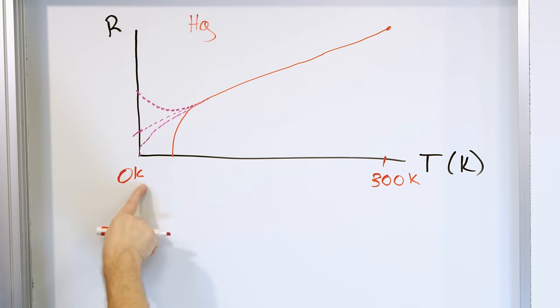So if we increase the temperature, we disrupt the whole thing. If we push too much electric current through, we exceed that critical current density. Remember I said there was a critical current, you can't go beyond that. Somehow, when you put too many electrons through, you disrupt the Cooper pairs. We don't know exactly how, and then that turns the superconductivity off. And the critical magnetic field does the same thing. When we have too much of a magnetic field, it generates eddy currents somehow, which are so high that they disrupt the Cooper pairs, and so on.